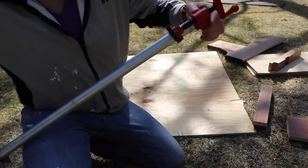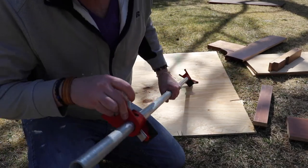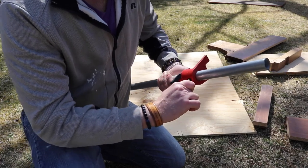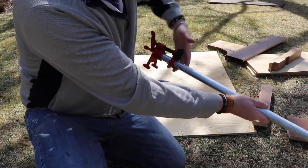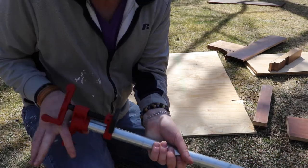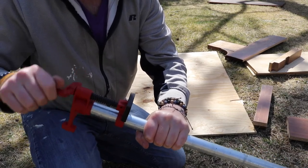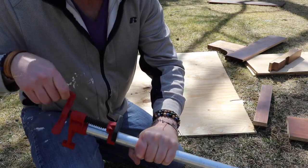So they're really easy to set up. Basically, all you need to do is this end here just slides using these tabs. Try to show you better. You just pull the friction on those tabs and it'll slide out. So you can set your end there. And then this side, every galvanized pipe has a thread on each end. So you screw this onto the threaded end as your anchor there. And then this is where you push it out or in, right? So you get very close with that end, and then you're going to use this end to tighten it.